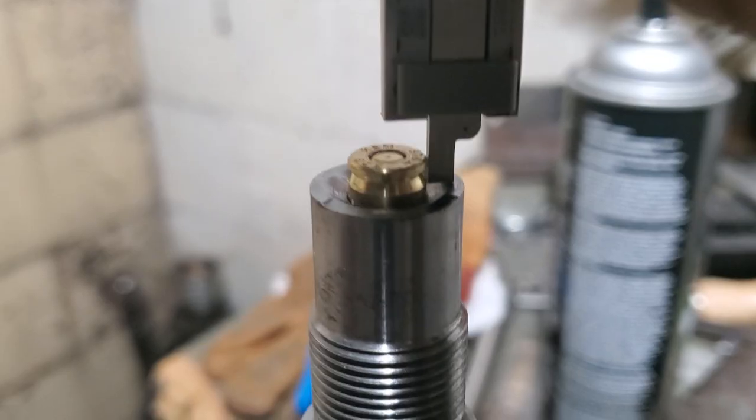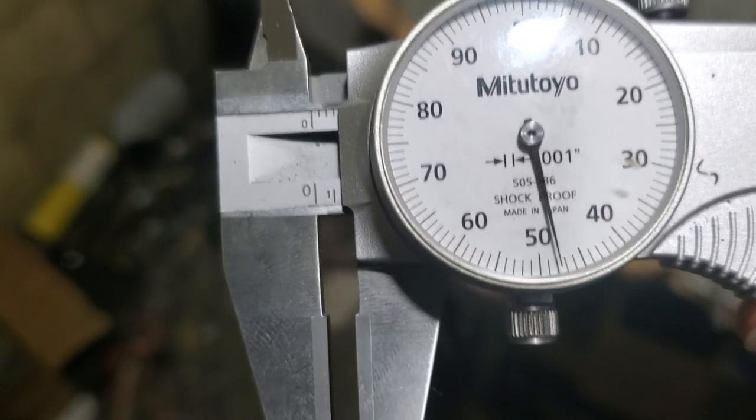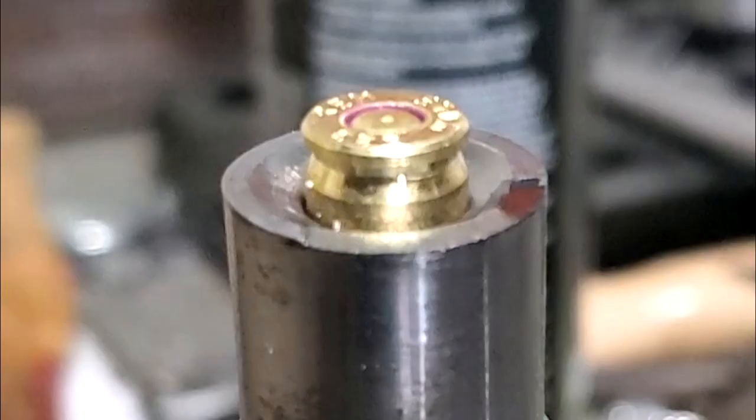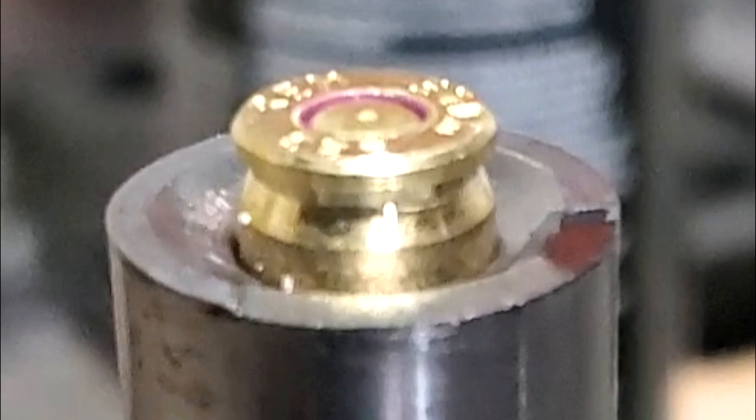I polished it up, called it a night. Looking at it closer, the back of the case sticks out about 150/1000ths from the flat part of the face, meaning the base of the case is unsupported for an even larger distance than normal because of the enormous chamfer I had put there. Is this even safe? I wasn't sure, but wasn't gonna let not knowing stop me.